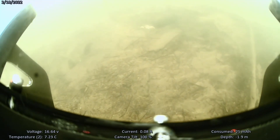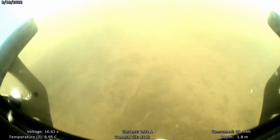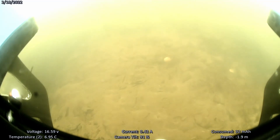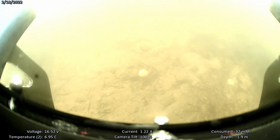Even though I couldn't see well, it was really exciting to discover what was at the bottom. Ooh, some golf balls! Everything seemed to be working well, and I stayed under for about 10 minutes. I decided to come back up to check to see if everything was okay. After pulling it up though, I found that there were some leaks. I later found that the water was coming in through some of the motor wires, and they needed to be sealed even better.